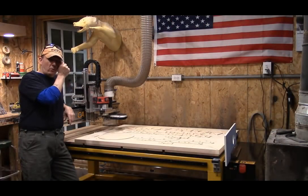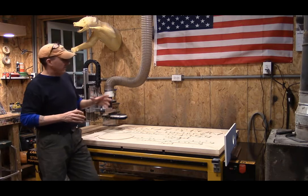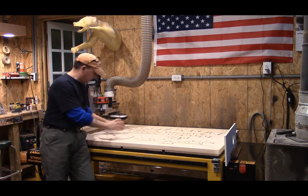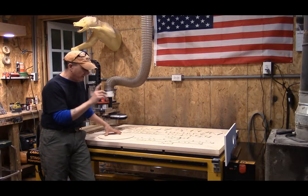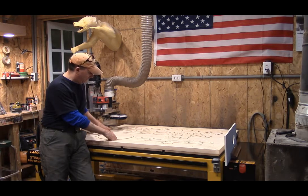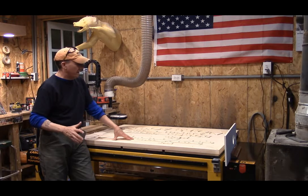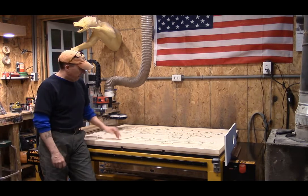We're back. We ended up dropping that half-inch two-fluted end mill in and hogged out the center really nicely, as you saw in the video clip. I told you there was a small scene going to the bottom left-hand corner, and I ended up putting in two circles — 13 inches on the exterior, 12 on the interior. We changed our cut depth around — no way did I need to go 375 thousandths. We ended up going 300 thousandths, so we're just a little under 5 sixteenths.